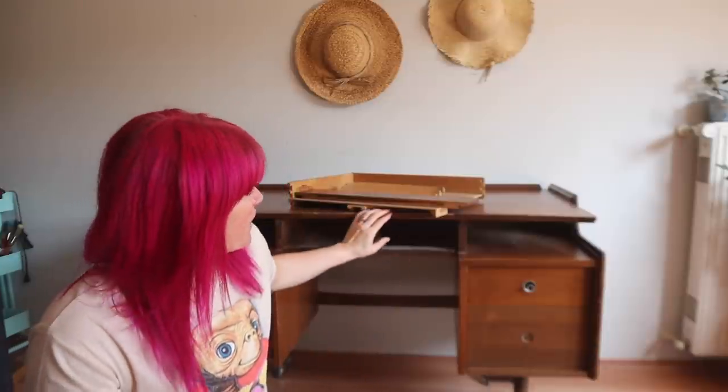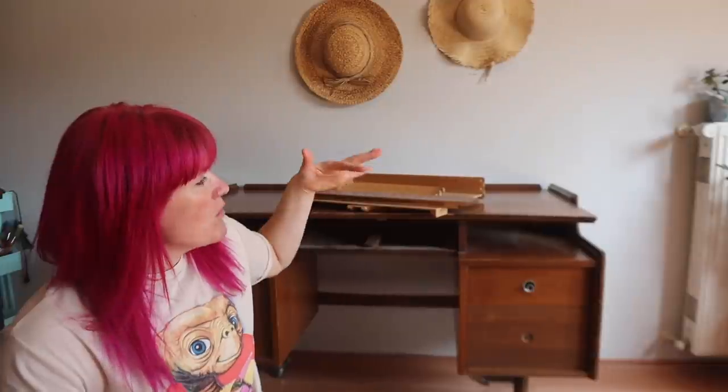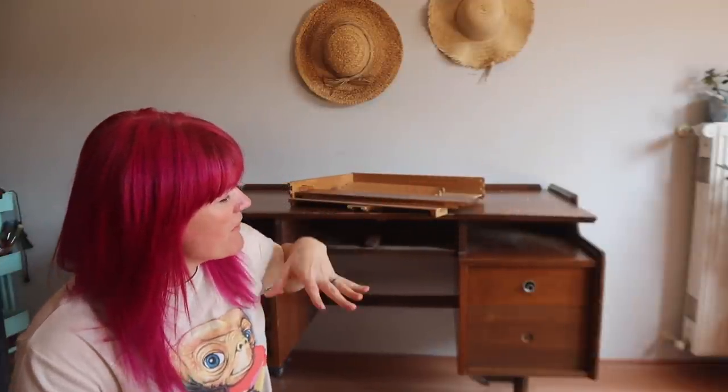And so we are going to refinish this all in walnut, a walnut stain by Lignocolor, and I'll show you guys that. It's a water-based stain. And I'm going to be sealing it with Wise Owl's 1 Hour Enamel Clear Coat, and we're gonna be using the satin so that it has a tiny bit of sheen, and that way it stays within the realm of this era and having kind of a sheen on top of everything.